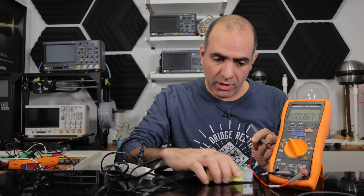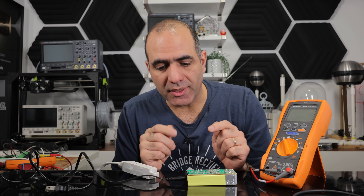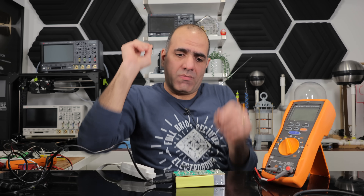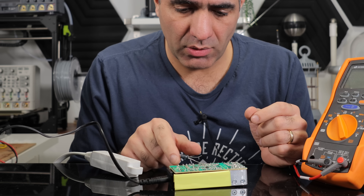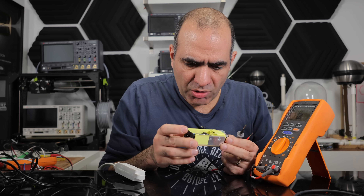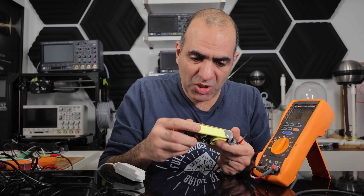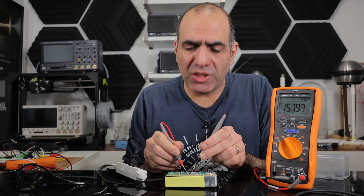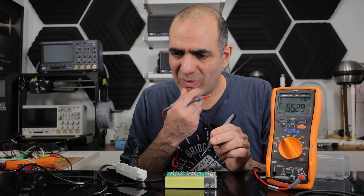Is there a burn mark on this? Always disconnect power before touching a circuit, and always make sure the circuit's high-voltage capacitors are discharged before touching it. There are a few input filter components, the rectifier and its capacitor. Measuring the voltages: around 115 volt AC input, around 160 volt rectified DC. So all seems good there — must be the controller circuit.